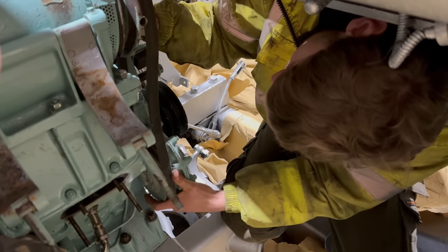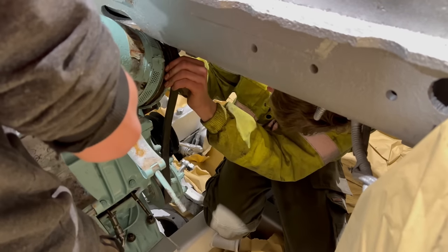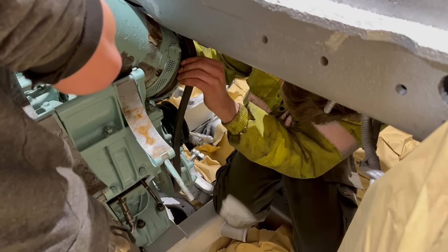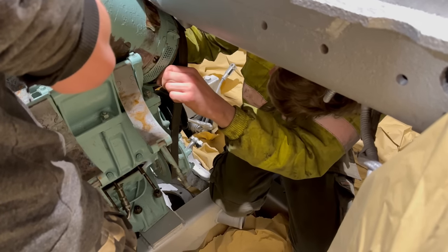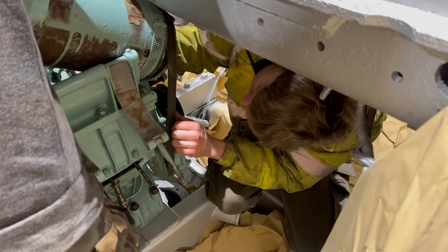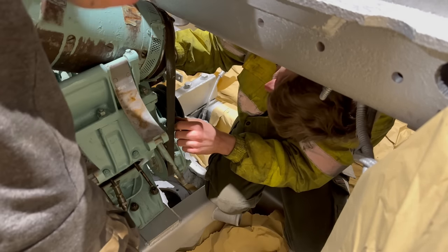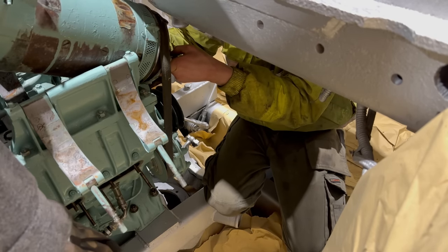1989. Beautiful. Fitting the generator on one of these engines is a real pain in the backside. They're ever so heavy, and there's only a single dowel that actually locates it in the right place, and it is an utter nightmare to get in with the belt on, especially when the belt's brand new and tight as a tight thing. You need to lift the back, and push it towards me.